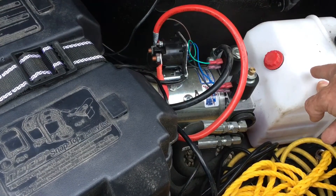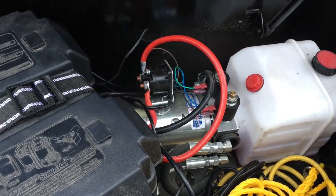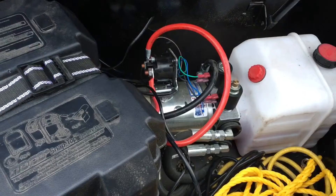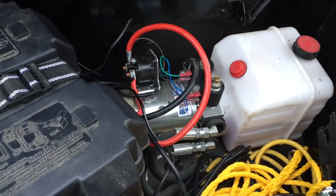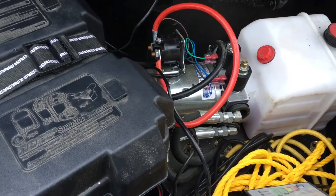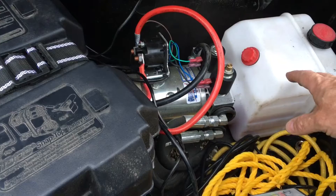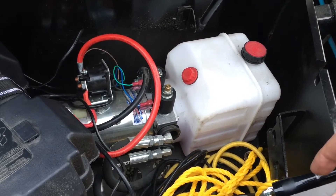Normally the pump would be running, pumping hydraulic fluid into the other side of the cylinder. So if you gravity feed it down, or if the battery is low enough where the pump isn't moving fluid fast enough to keep up with the ram coming down, there should be hydraulic fluid in both the extend and retract sides of the cylinder at all times. But if you let it gravity down, it won't fill one side of the cylinder, and you'll end up with a lot more hydraulic fluid in the reservoir that might overflow.